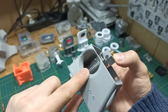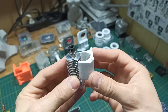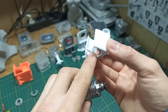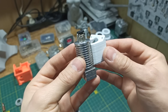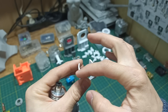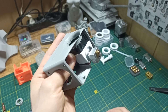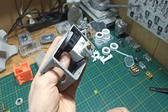Now the only remaining question is mounting the cooling fan. And here I also made a small modification — a special adapter which we install on our heatsink. By the way, the heatsink diameter differs slightly from the standard E3DV6. The fan mount has a special rib which inserts between the fins of our heatsink, and is thus fixed rigidly. Also note that this part should be placed on the table like this to get maximum rigidity and flexibility. We insert the adapter — here we can attach a 30x10 fan. This modification will be useful for those who want to save a bit of money or have a limited budget, since you can even use the stock hotend.